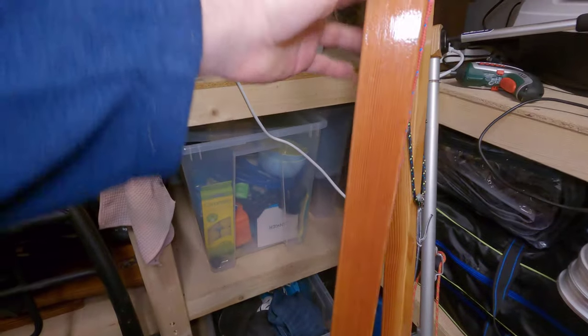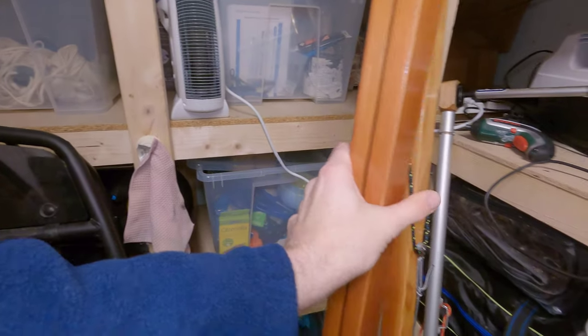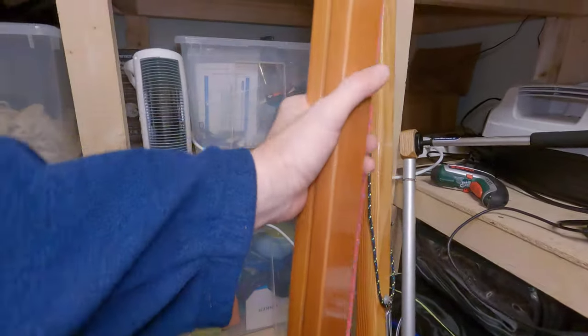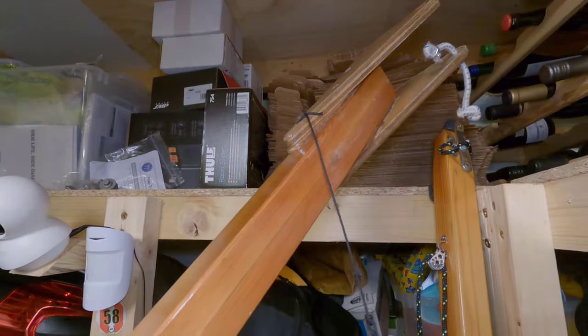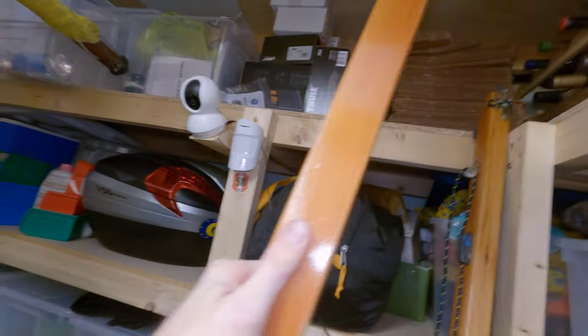The gaff is here. There's not much going on with the gaff - there's some tiny little bits where there's been some scuffing. These just need a little sand by hand and a quick varnish over. The top of the gaff does need a little bit of attention - it took a bit of a beating from capsizing this season. So we're going to check all the screws in there, get it nice and tight, properly varnished up and secure for next season.